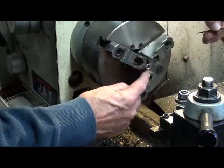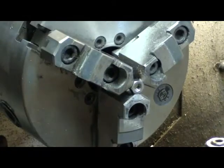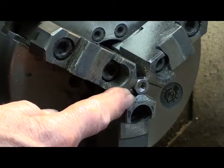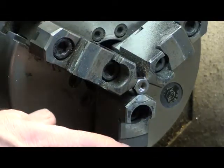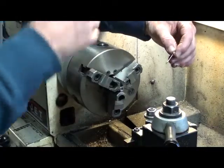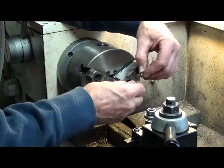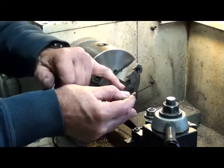There's a nut in the lathe right here. We are zoomed in. So we just used a three-jaw chuck — don't have to dial nothing in. The threads on this jet are very close to a one-quarter-twenty thread, and it jams after it threads in there for two or three revs. But we don't care, because all we're doing is turning this little shoulder right here.